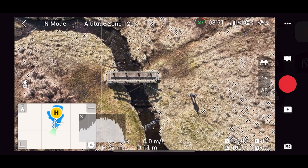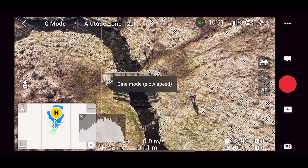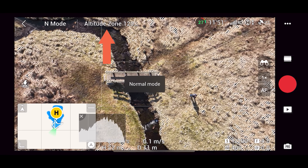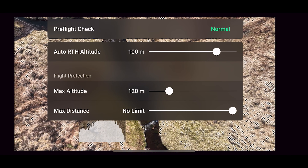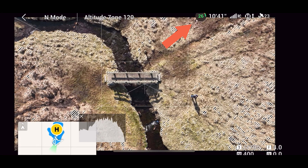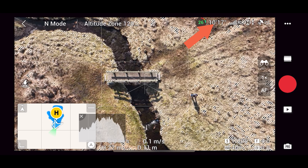Now let's take a look at the app. The first thing you'll see in the top left is the flight mode — normal, cine, or sport — and any changes will be reflected there. Next, you have your drone status, which tells you if you're okay to fly or if something needs attention, like restricted airspace, compass or IMU calibration, or wind warnings. Tapping it lets you adjust return-to-home altitude, max flight distance, and max altitude. There's also a battery indicator showing the percentage left, and tapping it shows when automatic return to home kicks in, forced landing, and how long until the battery is depleted. The time remaining is also displayed next to the percentage.